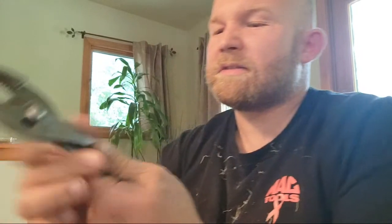This is so nice, just sitting here feeling this after putting that polish on it. And I probably didn't even do this completely. I don't know if I did this super correct or not, but I've watched other guys do it. They'll take their polishing wheel and pull polish onto it and polish the metal. Then once everything's pretty much polished, they'll take a tool and clean off the wheel to knock all the residual dirty stuff off, and they'll use the dry, clean part and repolish back over it again just to give it that last shine.